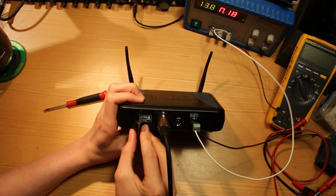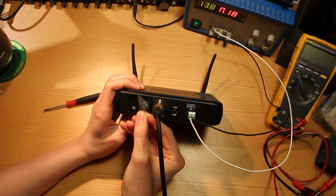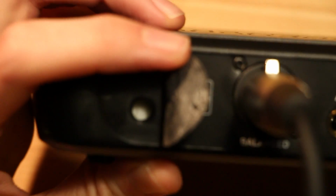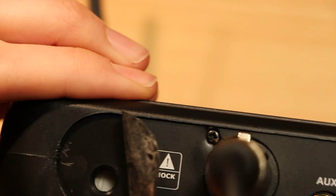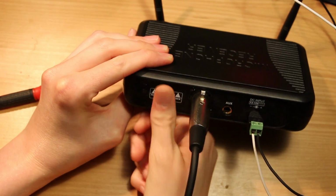Well, that first divot, I don't see a screw or an adjustment potentiometer or any of the usual things you'd expect to see in there. It looks like the edge of some kind of board-to-board connector. Yeah, and if I look in there closely, I can see what looks like a 4-pin JST wire harness to board connector back there. Maybe the front and back of this have two separate circuit boards. Either way, that does not appear to be the way in. Cover that up like nothing happened.